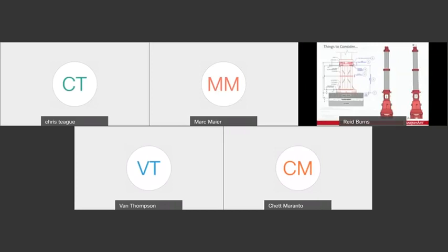And so minor deflections and layers, they're additive, and they can lead to disaster. So it's very important to not use compressible material between any layers of your stack track arrangement. So steel shims versus plywood, don't use compressible rubber. Just make sure that when you're putting a load on that stacked arrangement, that nothing's going to compress differentially and allow the system to get out of level.